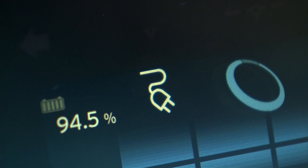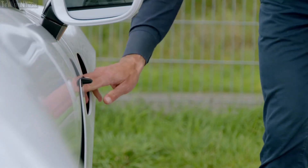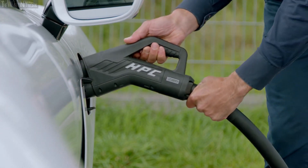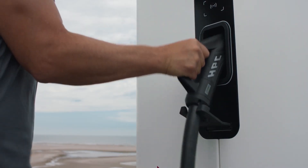The prototypes were developed with a view to delivering up to 100kW of DC charging. But at the time, the vast majority of cars were limited to about 50kW anyway, so the early chargers rolled out supplied in the region of 50kW. Thankfully, the development of the CCS standard didn't stop there. Fast forward to 2015, and the advanced technology allowed CCS to develop and show 150kW chargers. And now in the 2020s, we see the rollout of 350kW chargers. The progress is astonishing, rapid, and very welcome.